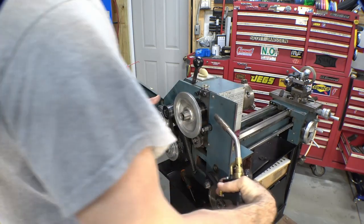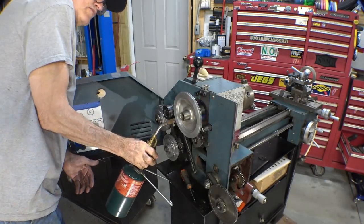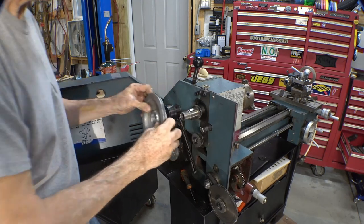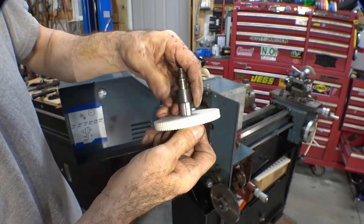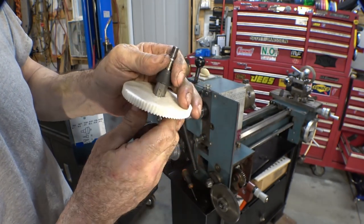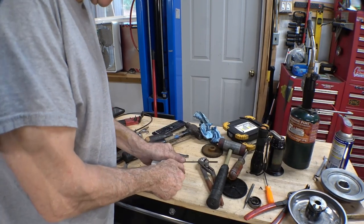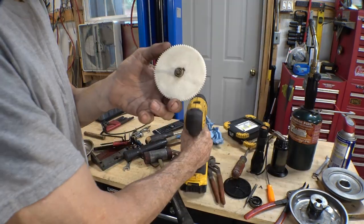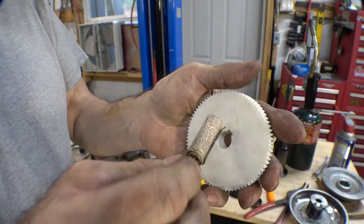Aluminum pulley, steel shaft. Presto. Very, very tight. Very, very, very tight. Get it over here on the table and put some pressure on it. Just see if it slides on down on there. Nope. This precision honing device is a piece of sandpaper wrapped around a large cutter key.